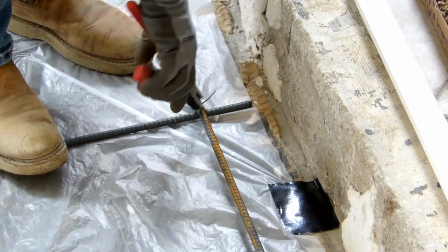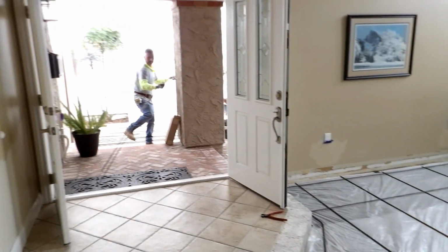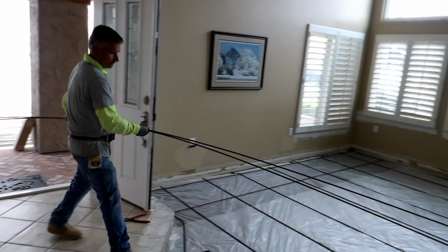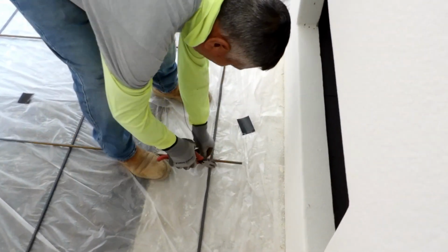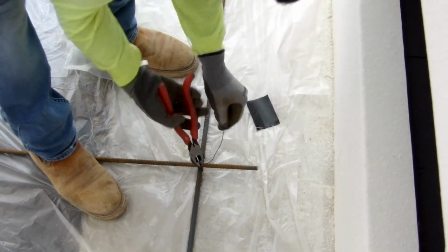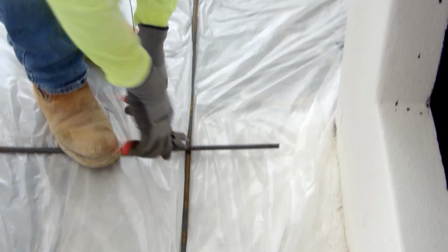And that's about it. I use a 3000 straight cement, but use a 2% Polar Set. CC doesn't work indoors, and CC will eat the rebar. A lot of people don't know that, and a lot of people think rebar helps with cracking, but it has nothing to do with whether the concrete is going to crack or not. This concrete will never crack, not only because West Coast did it, but also because they're putting a wood floor on it, so you won't be able to see it anyway.